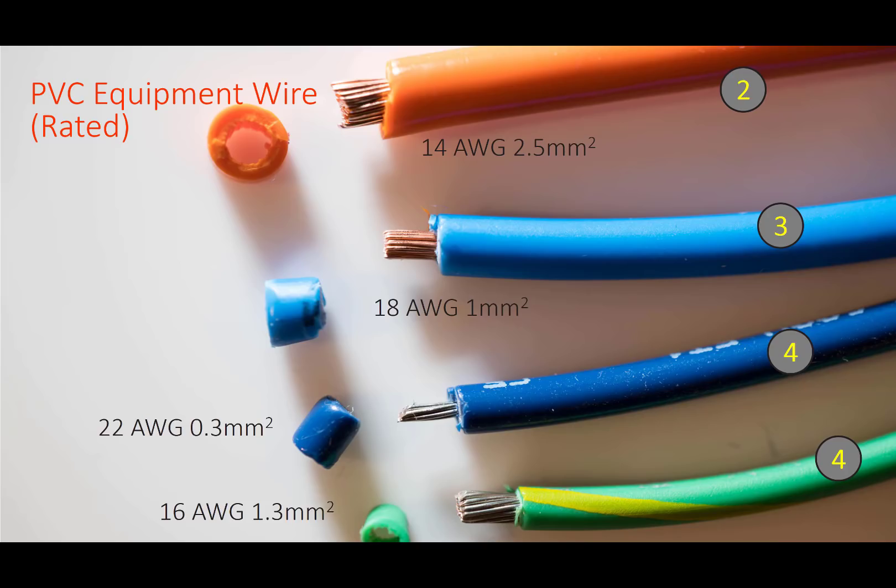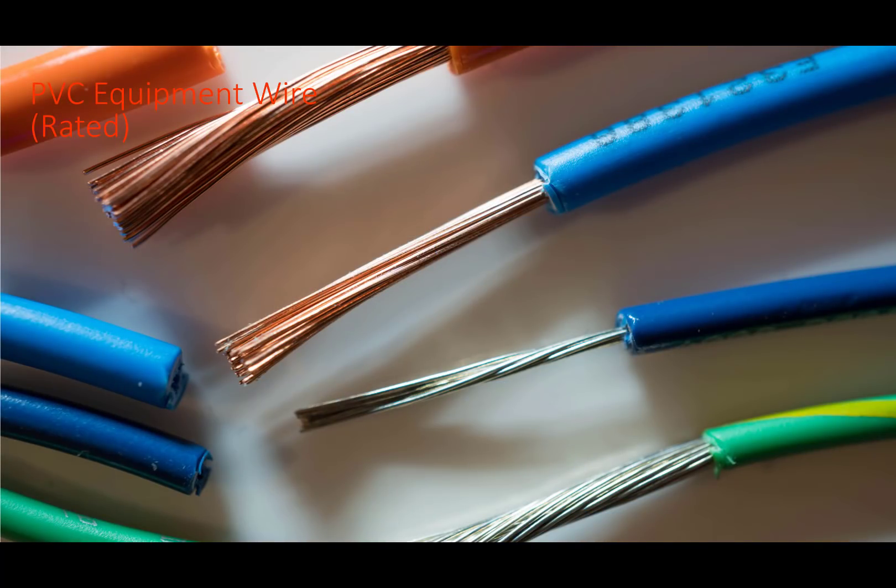If you look closely at the insulation you can see there is a step near the cut. This is because the flat sides of the blades when pressed together have about a 0.5mm gap, so there is a very tiny gap between the blade pair that holds the insulation and the blade pair that stripped it. When the blades are separated, sometimes the insulation is cut and tears slightly — this is just an artifact of using four blades. But in context this step size is tiny; it just looks large because this photo is zoomed in. The amount of wire stripped here is just three millimeters, just to test if the wire could be stripped at such a short length. Some wire strippers will just stretch the insulation instead of cutting because the blade is blunt or inaccurate. Next I stripped a further 15mm from the same wire ends, bringing the total length to 18mm. There was absolutely no problem at all — the wire looks clean, no nicks are visible at the original 3mm location, and no strands were lost.